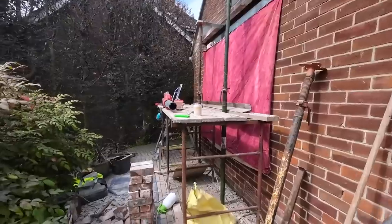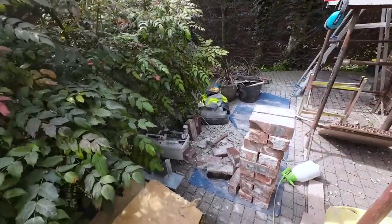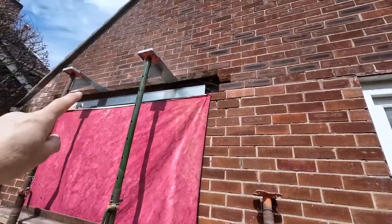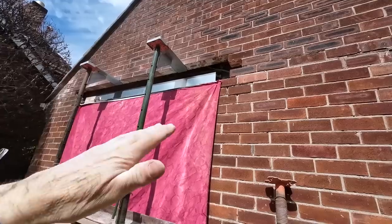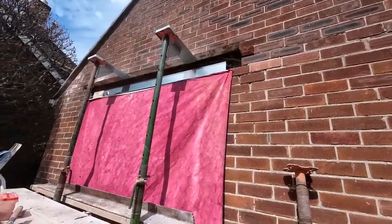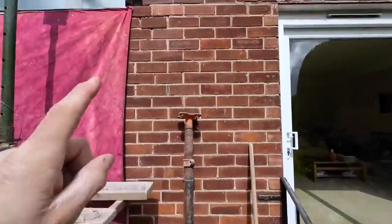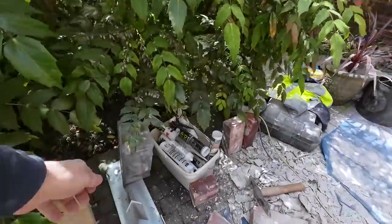But yeah, update, it's 1 o'clock. I've had to nip to Fields to get a bag of nails for 12 quid, because I needed three nails. What I always do, when it's a timber lintel, is put 3 4-inch nails into the timber lintel against the back of the new lintel, and it stops it tipping, which it always tries to do. So that could be done. I've measured up for my cavity tray, which is going to be 2.6 metres long, which allows for an upstand at each end. The weep vents are in here.